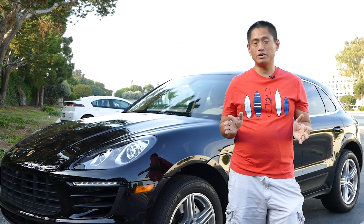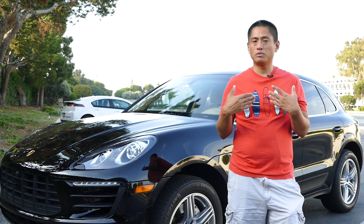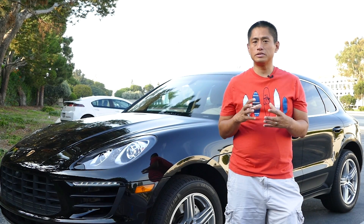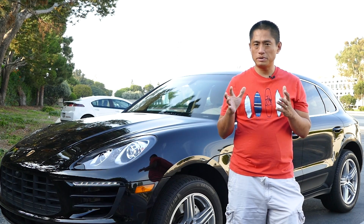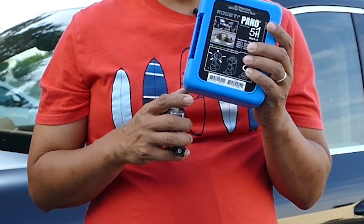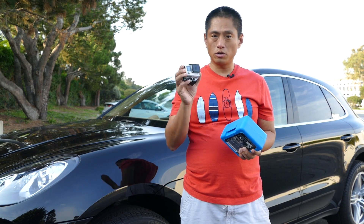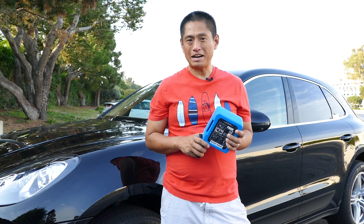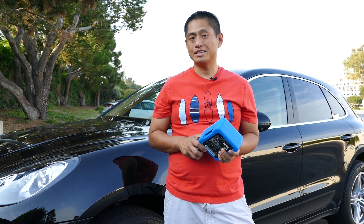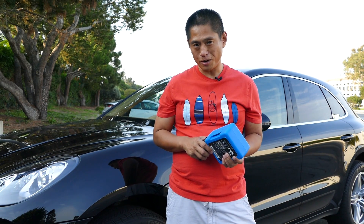360 cameras are very good for 360 photos and videos, but sometimes you want a little more resolution. The other issue is parallax stitching error — it's a little harder to take 360 photos in small enclosed spaces, such as a car interior. The accessory I wanted to show you is the Pano 5 Plus 1 Mark 2, a panoramic head designed specifically for GoPro cameras. Using this accessory you can take a panoramic photo in as little as eight shots at a resolution as high as 65 megapixels, and if you use the Hero 5 Black you can even shoot in RAW.